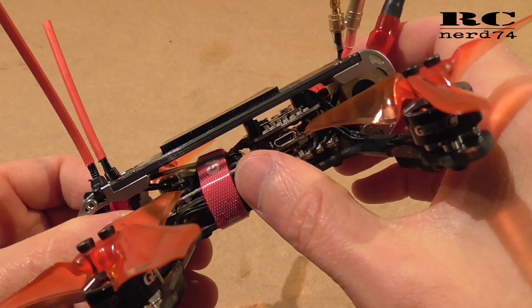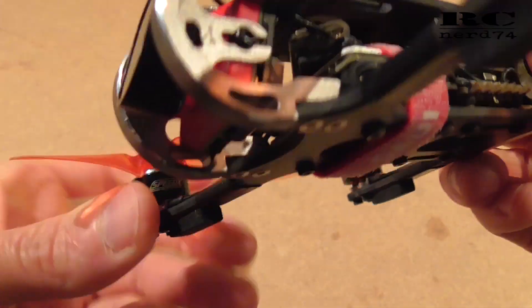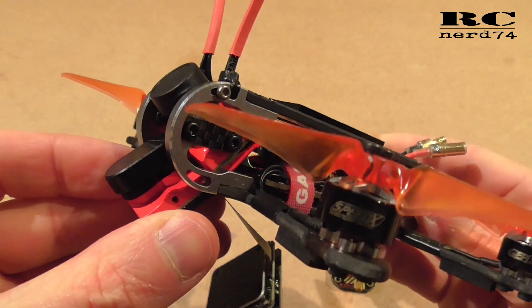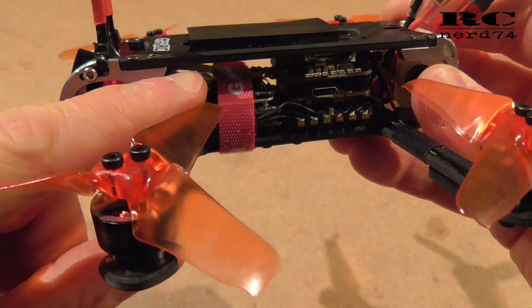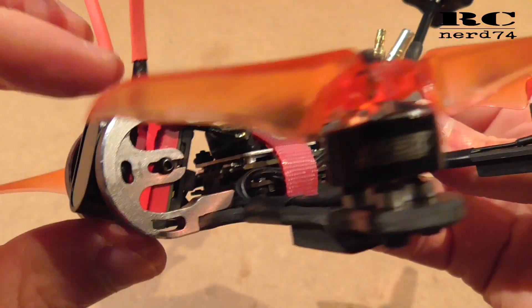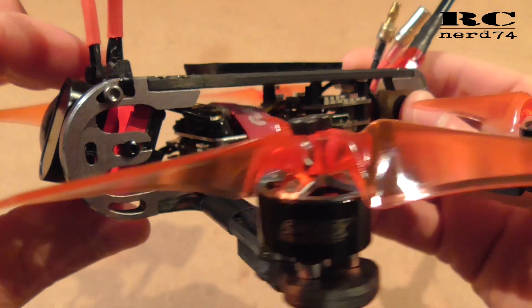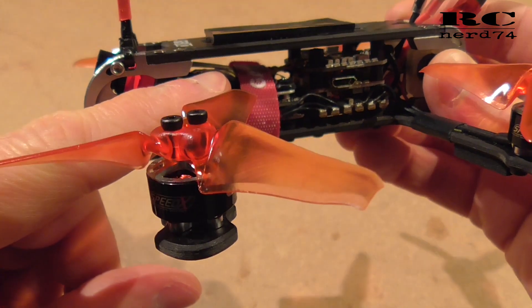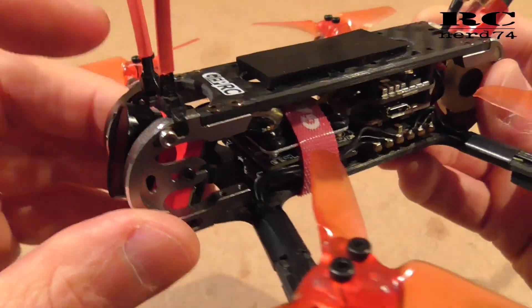To make the installation cleaner, I zip-tied all the cables so they're not flying around — this keeps cables stable and the build looking tidy. Looking at the camera installation itself, there's much more space compared to the Foxier Mix I used before, so you can easily set it to your desired angle. If you use the stock five-centimeter flat ribbon cable, set the angle to at least 25 degrees to avoid stretching the cable. For flatter angles, switch to the seven-centimeter cable also included in the kit.